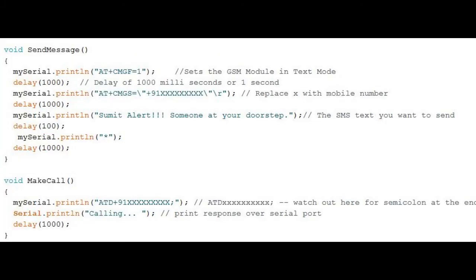Now coming out of the void loop, I have functions called send message and make call. So let's talk about send message. If you have seen that video in the description, you must not have any doubt why I am doing this, but still I'll tell you again. With serial.println, it will send data to your GSM module that text mode has been activated. Next you have to provide your mobile number in this section.